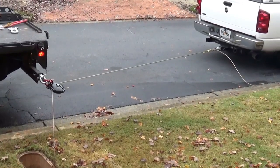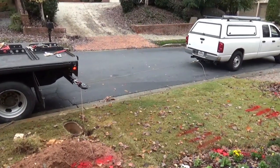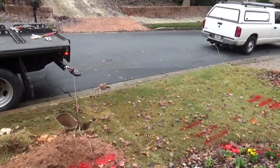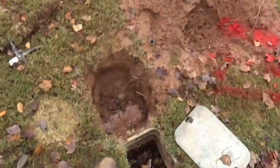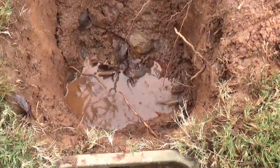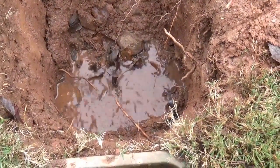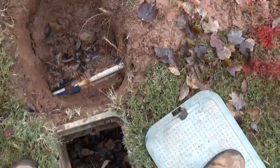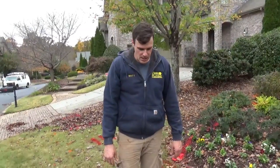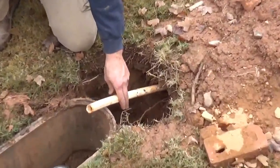Here's what was happening on the outside as that cable was being pulled through the pipe. We've got the cable hooked up to a pulley, and from the pulley we routed the cable to the other truck — it has a grabber attached to it. We're driving approximately 80 feet because we're replacing 80 feet of pipe on down the street. Now we're going to see the new pipe come through, and the new pipe has been pulled in place — 80 feet of pipe pulled in place of the old pipe.